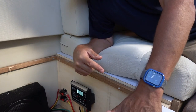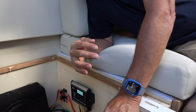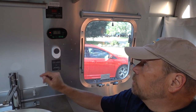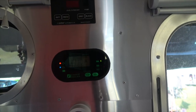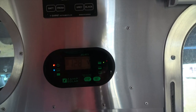Now we've put the system back online. You're probably wondering - you've got this thing mounted underneath the front lounge, how do you see it? Behind me is my remote panel and this allows me to monitor the system and shows me the condition of my batteries. Right now I've got 13.8 volts and it also allows me to monitor how much solar I'm bringing in. Right now it's telling me my batteries are fully charged, and I can cycle through it to tell me how many amps of solar I'm picking up off the roof.